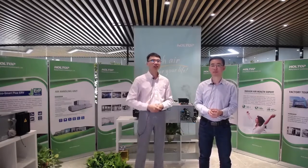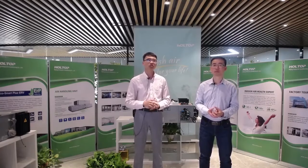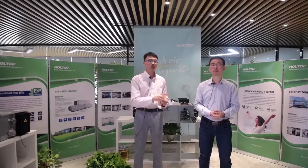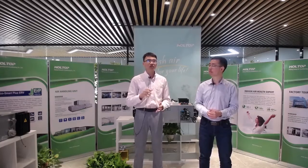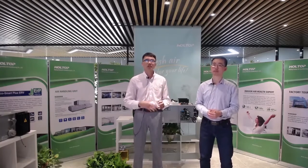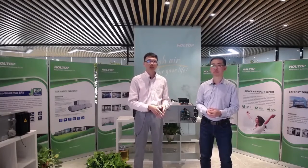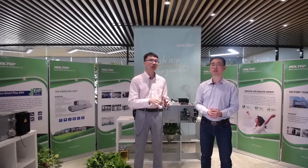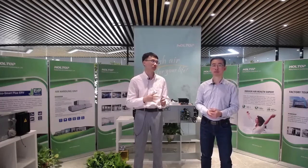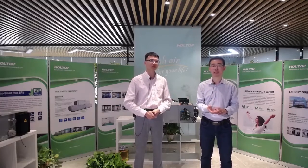We have another advantage of this product, which is the 2-in-1 refrigerant confluent technology. The refrigerant flow speed inside the coil matters a lot for heat exchange efficiency. During the heat exchange process, the refrigerant will condense, its volume becomes smaller, and its flow speed slows down, so the heat exchange efficiency becomes lower. With the new 2-in-1 technology, the refrigerant speed inside is always kept high, and the efficiency is kept high. So this is for the outdoor condensing units, the fin and the tube.